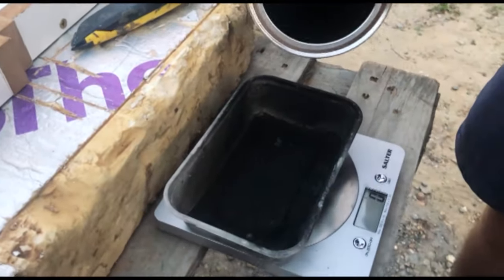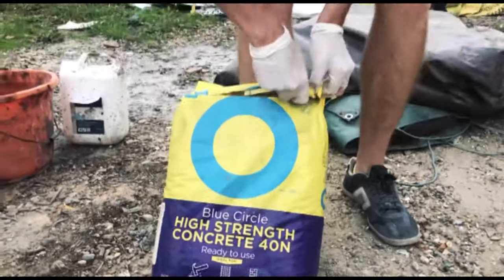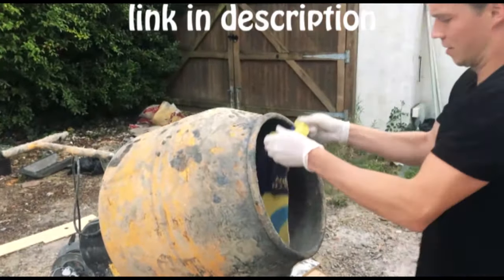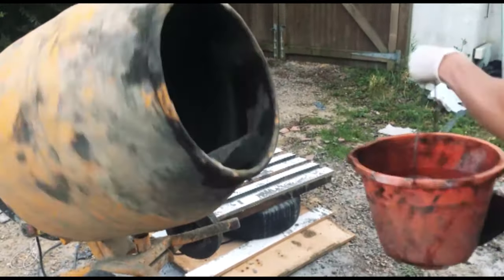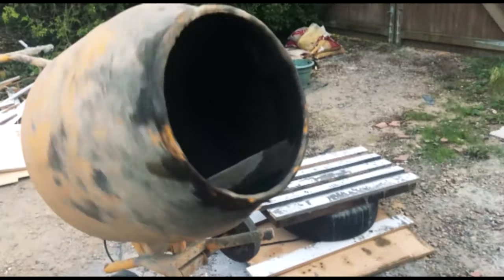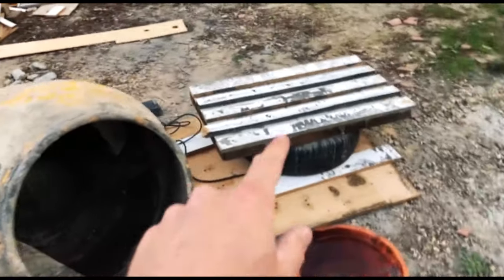For this shelving we're mixing in four percent pigment to the concrete and mixing it dry in the mixer first to make sure it's evenly distributed. You can see how that's been calculated and find all the other products and tools used in the description below. We're then adding mortar plasticizer to make the concrete as workable as possible, followed by water. Aim for a really wet mix, but not so wet that it pools on top after vibrating — wet enough to fill all of the surface once vibrated, as too dry a mix will leave porous holes on the finished surface.